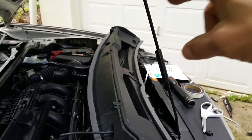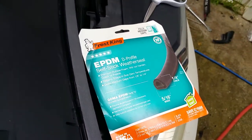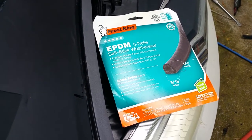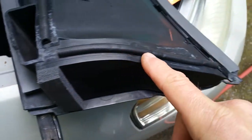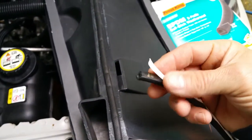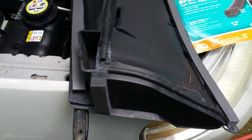It also required some here and on the other side, right up through there. This is called D-profile weatherstripping. You can get this also in the weather stripping section of most major hardware stores and big-box stores, because it's in the shape of a D. I put it along through here and across the top. It also has just a strip of adhesive on the back — very easy. Just make sure everything is clean and dry, then peel the backing off and lay it on down, just like any old weather stripping.